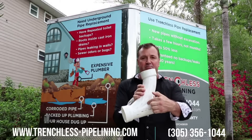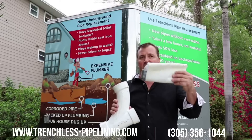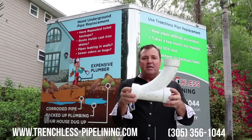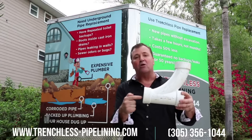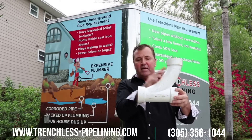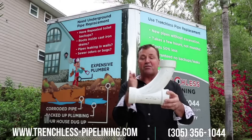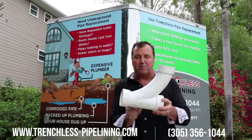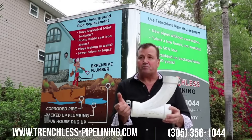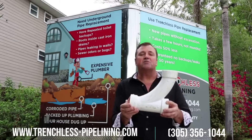That way we don't cover up the connection, but it means there's a small area of pipe that is unlined with cured in place pipe lining. This isn't as big an issue as you'd think, because the fitting — called a Y because it looks like a Y — is about twice as thick as the pipe going into it. With video cameras we can see cracks in the bottom of the pipe, but the cast iron Y is twice as thick and doesn't have cracks. The lining overlaps into the thick part of the Y and skips over it, but it's usually not an issue because the Y has about a hundred-year lifespan.